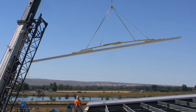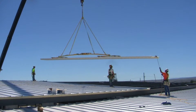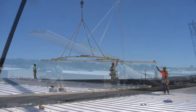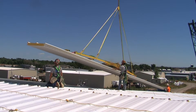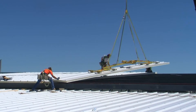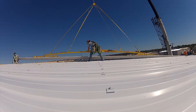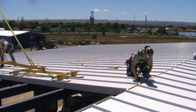They especially liked the Panel Master for roofing panels. Wood's Power Grip suction cups worked great on both wall panels and roof panels. Compared to slinging, the old way would bend the sheets and required leaving space to remove the slings and slide them over. With the suction cups, panels can be set right where they need to be — it's faster in removal and much nicer.